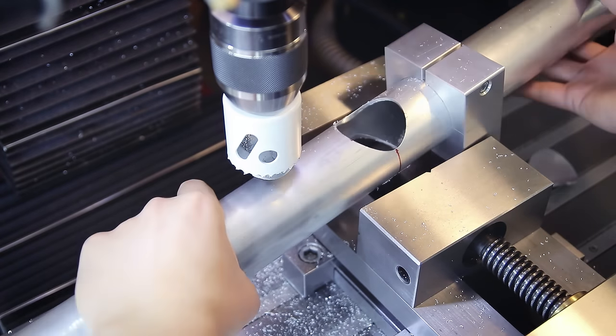Since I designed this jig to work in conjunction with the table, I can actually set it up vertically now by installing the main piece that holds the bottom bracket to one of these angle brackets, then I can level out the down tube and hold it at the head tube as well. Now everything should be squared to the table again so I can keep using that as a reference to attach everything else. I'm once again improvising some further additions to the setup using T-slot profiles — I put together two columns that I can attach to the table, each getting a horizontal piece on top, and that's going to hold the other frame parts. Since the table itself is level, I can use the little angle box to see if my jig is square to the table.